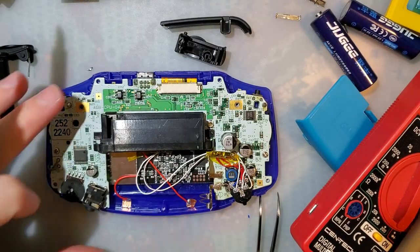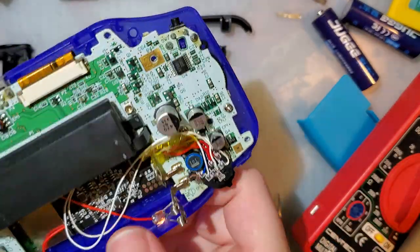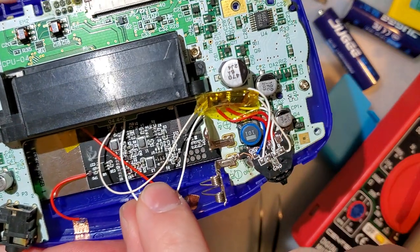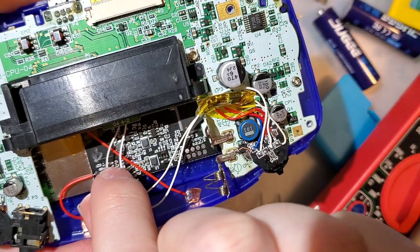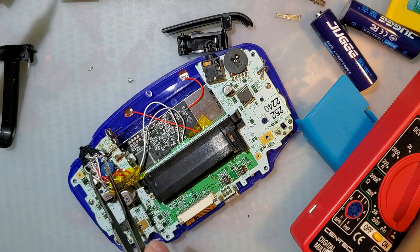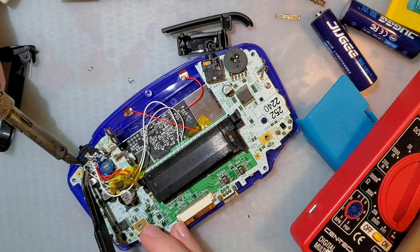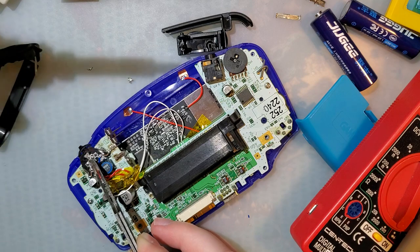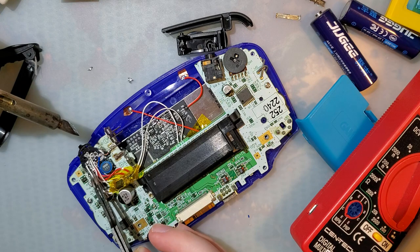So yeah, as you can see, it's a different kit in there now. I'm using the one chip, 2-in-1 kit. So this wire on the right here is supposed to be connected up to the left bumper, and this wire on the left here is supposed to be connected up to the right bumper. And I just had it wired up to the terminal labeled left, which makes sense. So we want the left terminal hooked up to the right label and vice versa.